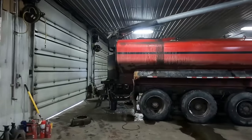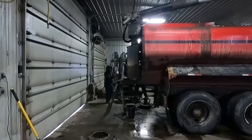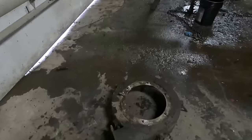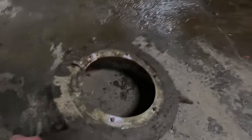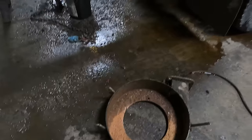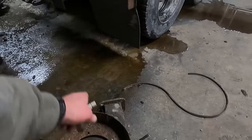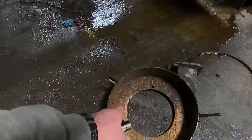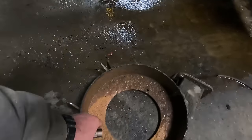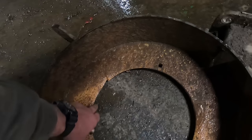7290. Before we head over to the field, we'll show you what these guys are doing to truck 12. They had a worn out fan housing here. They just put a new one on. This one was worn out. It was leaking manure up at the top, and you can see where the fan had kind of worked through it a little bit. It's real thin right here.